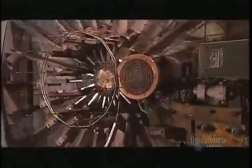Here, a worker is turning the machine manually just to show us the process in slow motion. This is what it looks like at the normal automated speed. As the rods pass through the machine, the welder fuses the cable to them in one continuous spiral. As the spiraled cable reaches the end of the rods, the machine's claws spread outward, forming a wider section on the end. This is called the bell section.